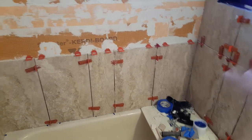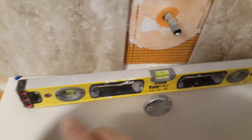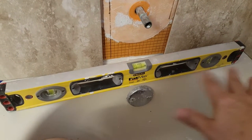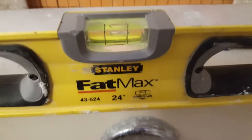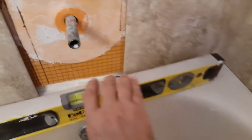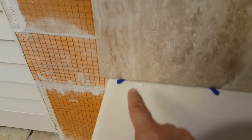It makes a challenge when you're trying to do tile because you have to go around it. Anyway, this looks pretty good so far and we're going to continue upward. This is also why you can't rely on your tub to be level - look at what the builder did here, this tub is far from level. I mentioned earlier that we put spacers under our tiles to adjust the heights a little bit, but in this case the same spacers are on these tiles and the top of the tile against the line on the Kerdi panel is lower on the left than the right. When I go to set these tiles I'm going to have to switch to a different spacer because I'm getting out of height here.